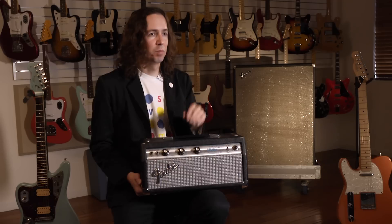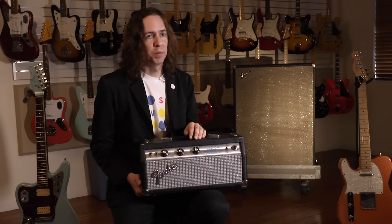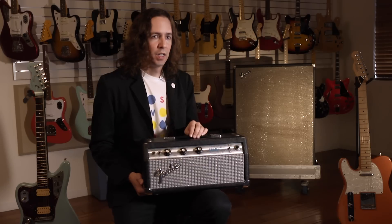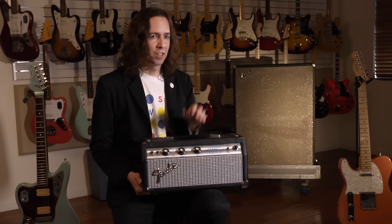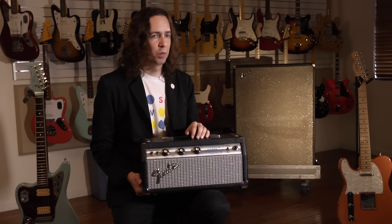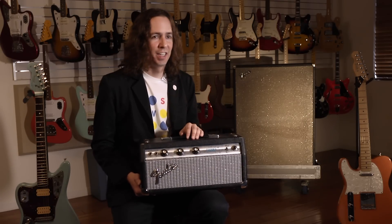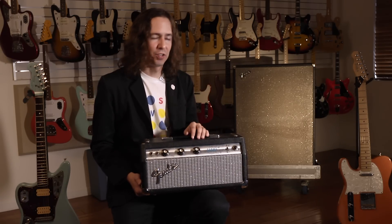For some reason, 4 ohms sounds the best to me for Fender heads — it's kind of matched to most of the heads like a Bassman or a Champ. I also rebuilt the baffle on that one, because over 40-plus years the thing started falling apart a little. So I went down to Home Depot, had them cut me some wood, stretched the grill cloth over it again, and rebuilt the baffle — so it's super solid right now.